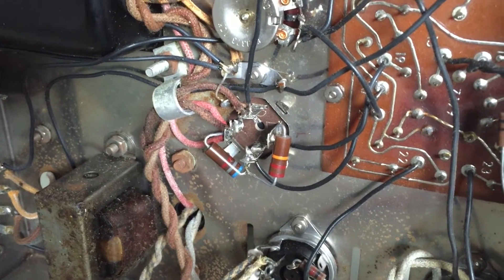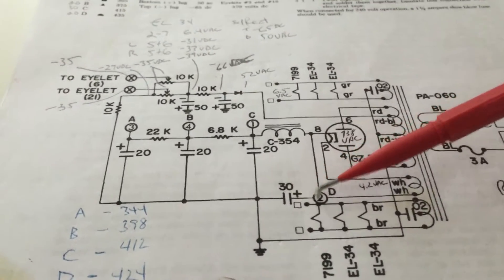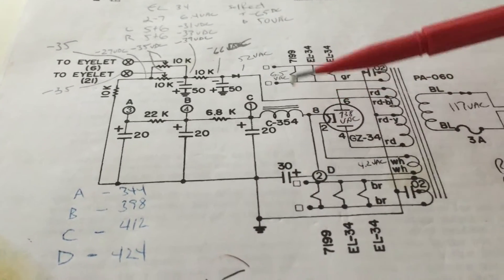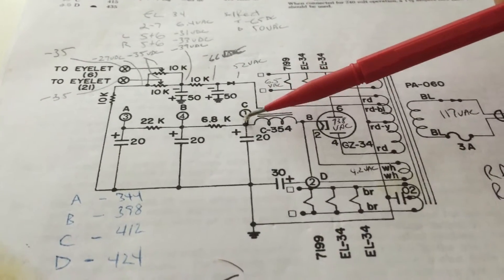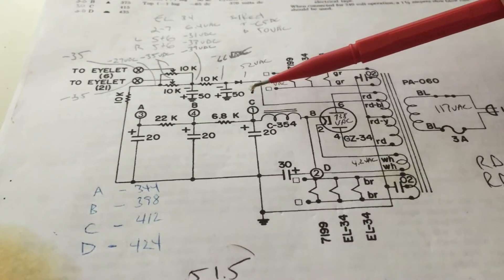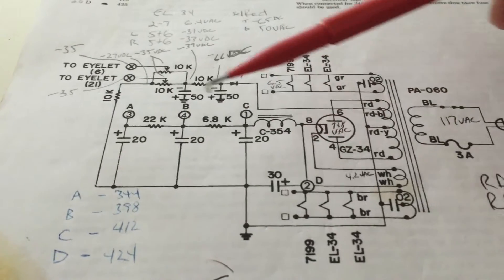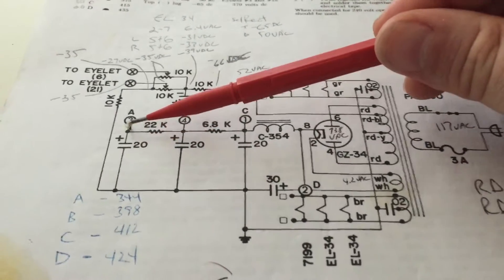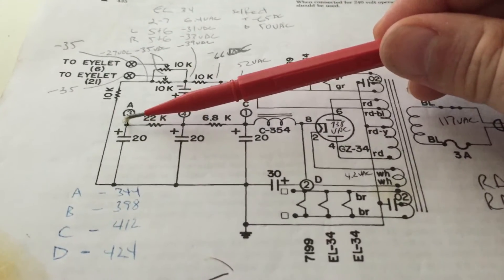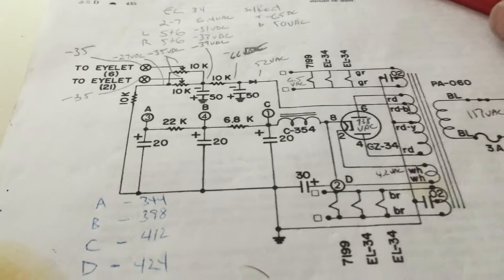This multi-core capacitor serves the same exact function on a different circuit. On this circuit, all positive sides of the capacitor are in circuit and the negative side is clamped to ground — obviously, because this is a circuit with a positive DC voltage. These capacitors allow for greater stability and filtering of ripple from the DC. What we're looking for is a stable DC waveform with as little ripple as possible. If the circuit voltage drops, it would be picked up off the positive side of this capacitor, which would then reabsorb more positive voltage until it was filled. This is all about stable DC.